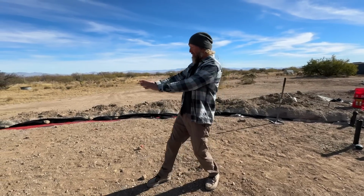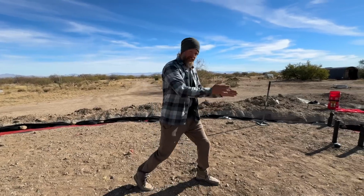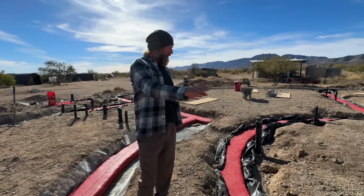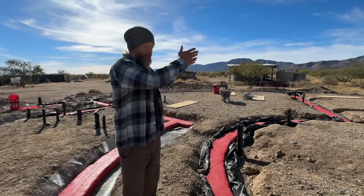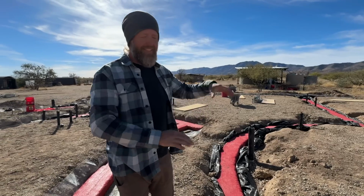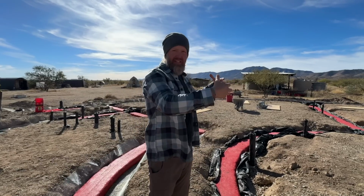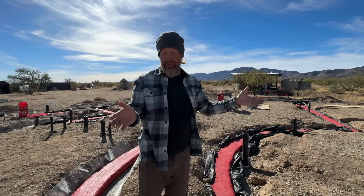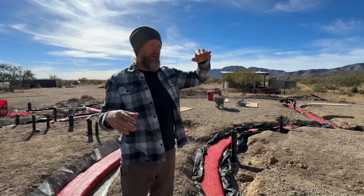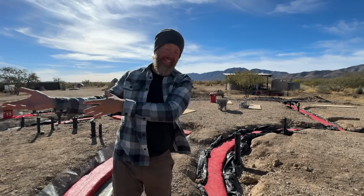And then yes, right in front of that wall, there's a small cubby hole for Ada to crawl through so she can get her snacks at night. Moving on, this inside wall, we are going to do several nice tall windows, maybe some more bottle bricks, with the idea that the top part of these windows will open because this is going to get a lot of sun. It's almost like an atrium, it's going to catch all that heat, and we want to open those windows up high so we can release that heat during the summer so it doesn't transfer into the actual bedrooms.